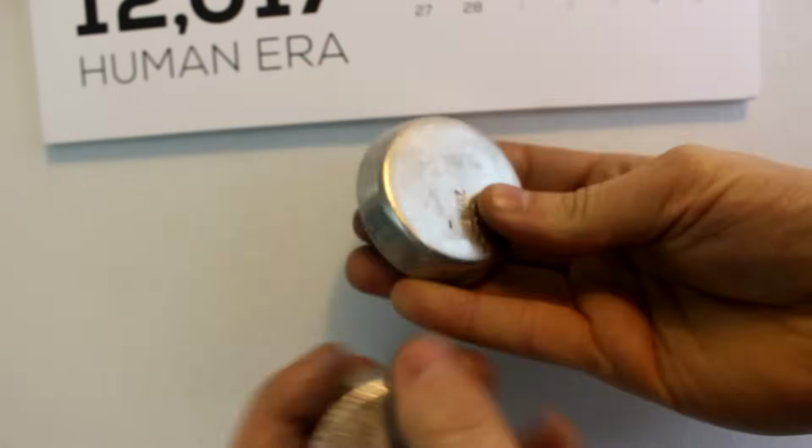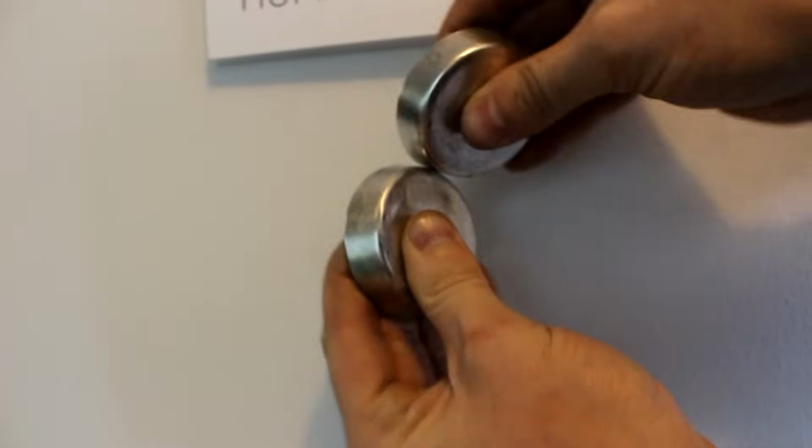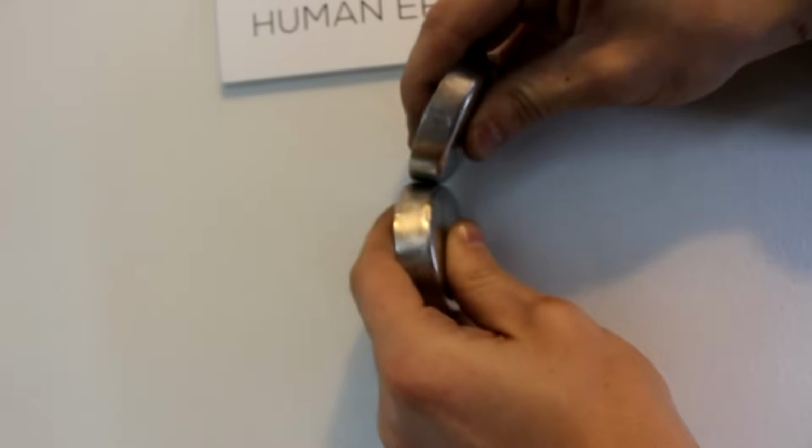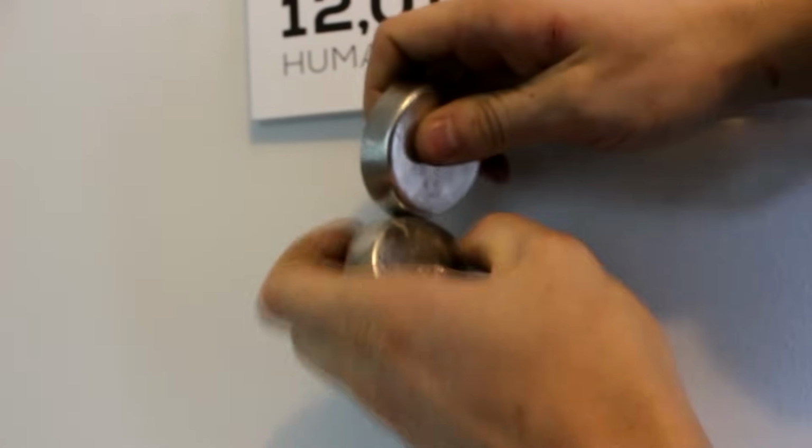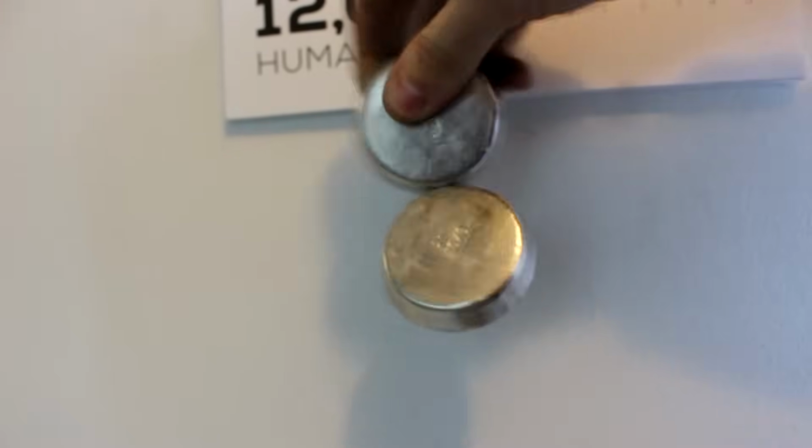And if you zoom in on it right around here, you can see that some pieces of metal right there and over here have actually been pulled off, because the bond was actually a good solid weld in those places. So I can take the pieces of metal and roll them past each other just like this. I can even push quite hard and they do not cold weld. But if I take them and then twist them a little bit, you can see that they're bonded.